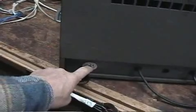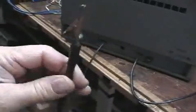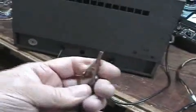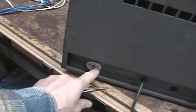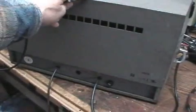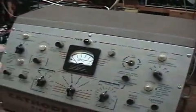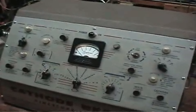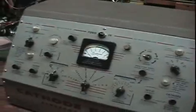The socket also contains the second anode voltage, which is why it's a porcelain socket. The second anode voltage comes out of here for the 3KP4 and the 7JP4 — this would normally be your second anode wire where you'd put your anode clip on a 10BP4. I've completely redone this unit, including replacing the oil-filled capacitor — which may have contained PCBs — with a microwave capacitor for the high voltage supply. I also checked and replaced any tubes, capacitors, and resistors as needed.